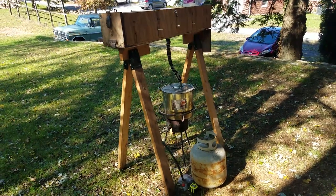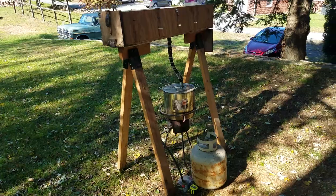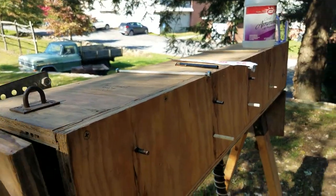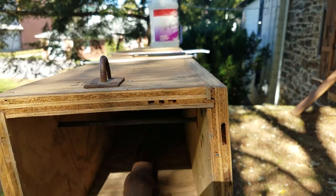I've seen pictures of steamers made out of stove pipe, PVC pipe, pretty much anything. Mine is made out of three-quarter inch plywood. It is four feet long. The inside is seven inches square. I simply made a simple locking joint to hold everything in place.